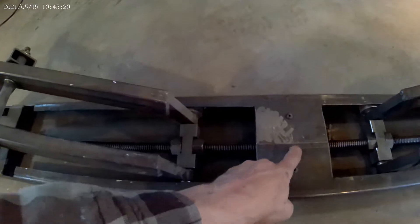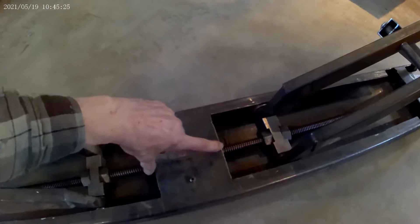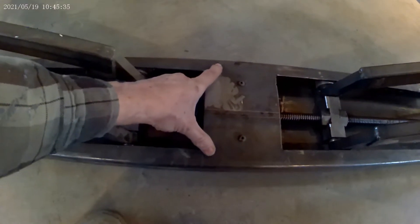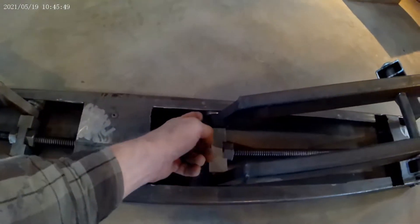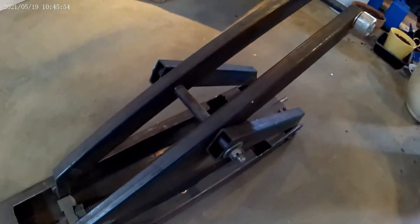In the center I have a coupling — there's a bar in here and a coupler that joins the two Acme rods together. I also have rollers running in what looks like an eight-inch channel. I've cut it out here and the rollers roll back and forth. It's a very simple design.